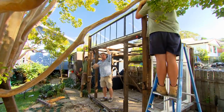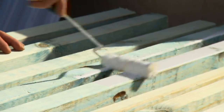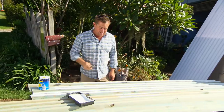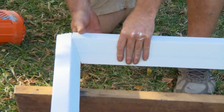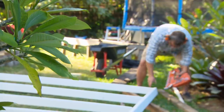Without the two posts that we'll take away later, there'd be no way to put this in position and keep it there. This is the timber for the roof. If I can give you one tip, pre-painting your timber exactly like this — where it doesn't matter what I drop on the ground and everything's just at a comfortable reach — is a lot nicer than doing it on a ladder. It'll take a tenth of the time and it won't hurt my back. With all the timber painted, I can build a simple frame for the roof. It's so much easier doing this on the ground and then putting it into position.